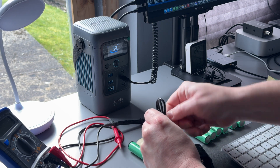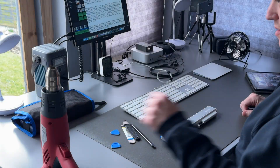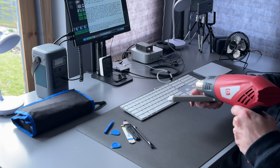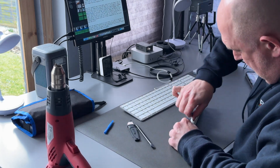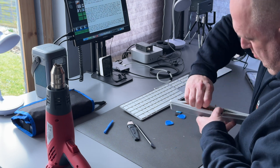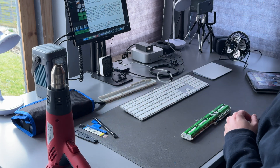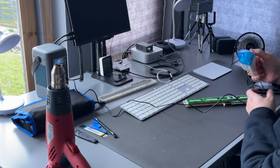Please note that I'm far from a professional, so please don't use this video as a guide — it's purely for informational purposes only and I'm not responsible for any issues that may occur. Hugh struggled to get inside the battery case, so I was prepared for a battle. Initially I thought gently heating the battery up would help loosen any adhesive. It was a case of trying to get something between the plastics to pry it open, and I used some picks and bendy tools, but it turns out all I needed was some patience and fingernails. I eventually managed to get inside and it wasn't half as bad as I feared. I'm not going to say it was easy, but that was the first hard bit out of the way. There are plastic clips around the perimeter of the battery case, and the age-old retro affliction is found here too: brittle plastics. Unfortunately, in trying to get inside, a lot of these clips broke, so we'll have to see how it goes back together again.